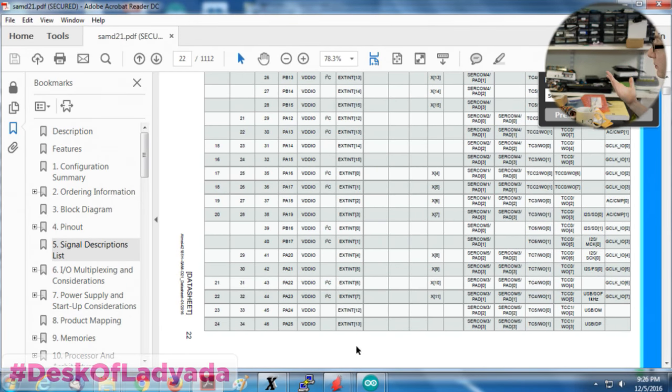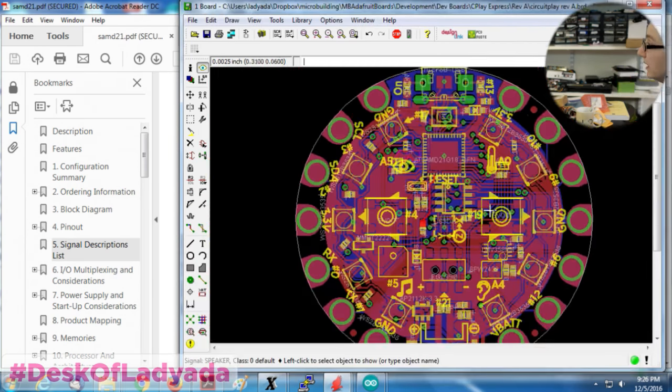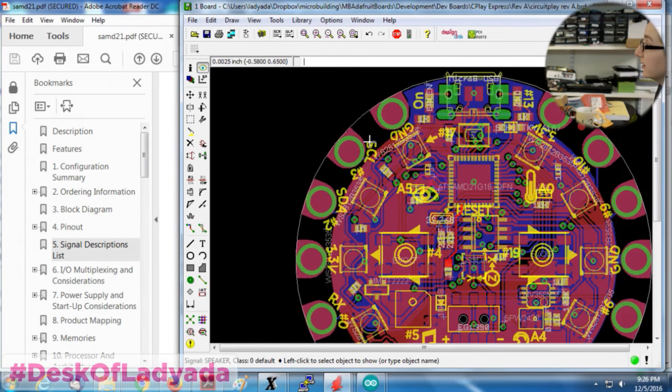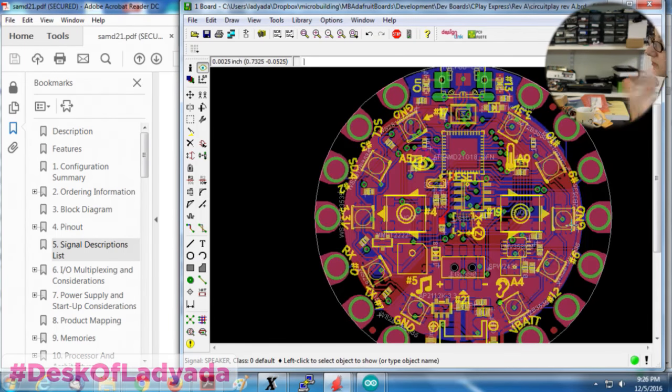We need 8, but not the pins that I picked. The pins on the right happen to all be on the Y type of capacitive touch, but the pins on the left are not. So what I want to do is, rather than try to get the Arduino capacitive touch sense library working, I'd rather just use the ASF core and figure out what code you have to write to get it to do the capacitance stuff.